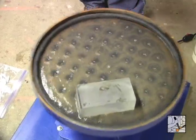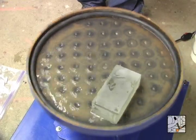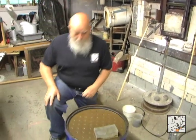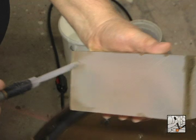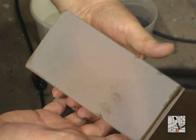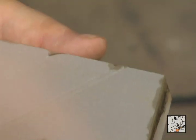If there are ways of protecting the glass, you can carefully do more than one piece. It's been a little over four hours grinding with 120 grit and a bit of water. Dried off, you can see the difference between the original surface and this surface. This is four and a half hours or a little less just running on 120 grit. Over time, the 120 grit probably wore down a little bit, so the next step will be 600.